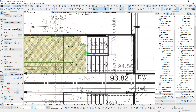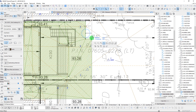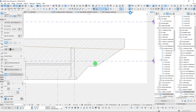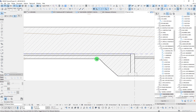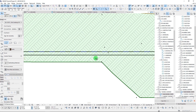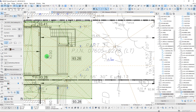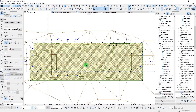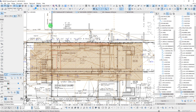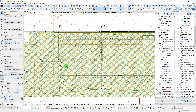You can see where we had that jog going on because of the change over here. If we pull this over and even that up we'll get rid of that. Checking it again - we only need to go 7.7 feet and right now we're over 9, so that's fine, we can leave that as is. Here in the middle we're going down to the foundations - we could probably leave this as is, we have an extra foot there. We may go in and just raise that up slightly. Let's turn on our foundation plan so we can see where that is - through this area here we can potentially raise this up a little bit.